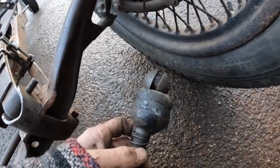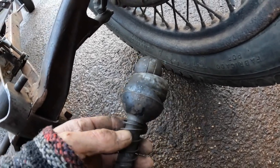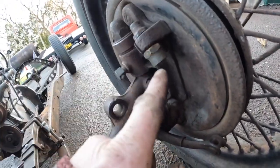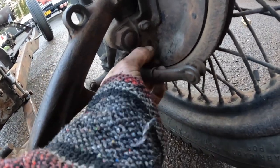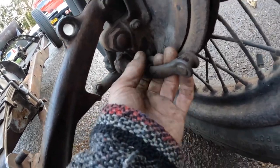Front brakes. So my idea of fitting this universal joint off the Citroen isn't going to work. It needs to run in the axis of the kingpin but that will put it right on the brake drum. There'll be way too much fabrication and modification on this back plate there. I'm going to go with cables.